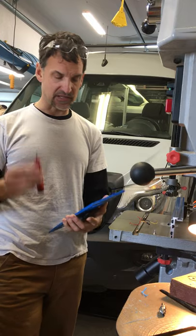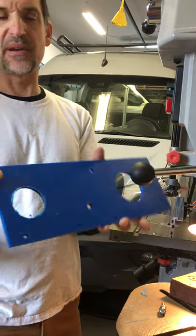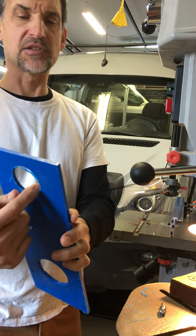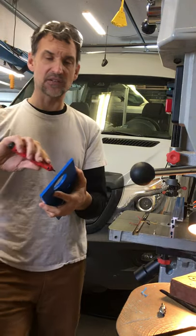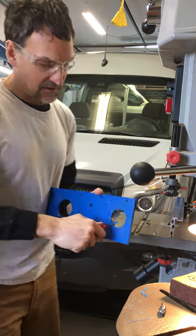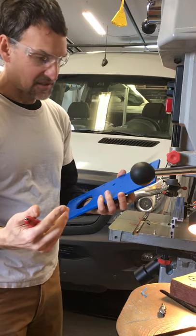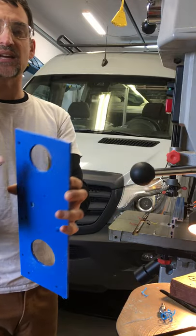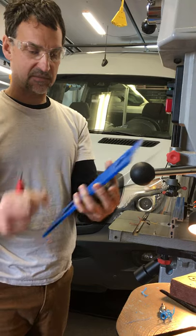But what I do find this is great for — if you look at holes like this one here — once you drill that big hole through, or even with a saw cutting it on a straight cut, you can see it gets a little roughed and jagged. So what I do is take this countersinking reaming tool and simply curve it around like so, and all of that debris just came right off. You can see it right here — the hole is now nice and clean and smooth.